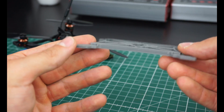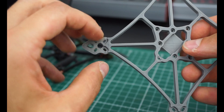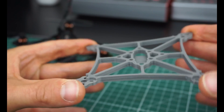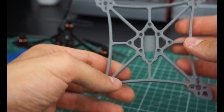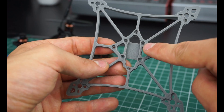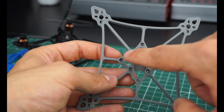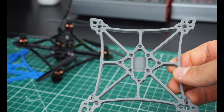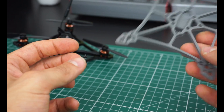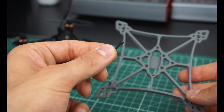Let's look at this frame. It's got 3mm motor mounts, with 9 to 12mm hole spacing. It's got enough stiffness through using these eight arms. You'll notice these countersunk screw holes — this is 16x16 for 16x16 stacks. We also have the standard whoop mounts for all-in-one boards. I use countersunk screws because this is all M2, and round head M2 screws strip super easily and are super annoying, so these cylinder head screws are much better.